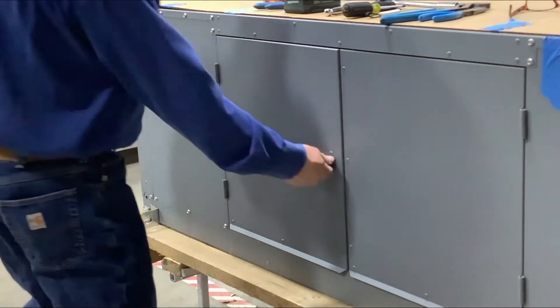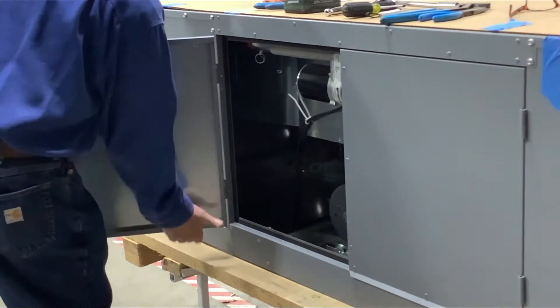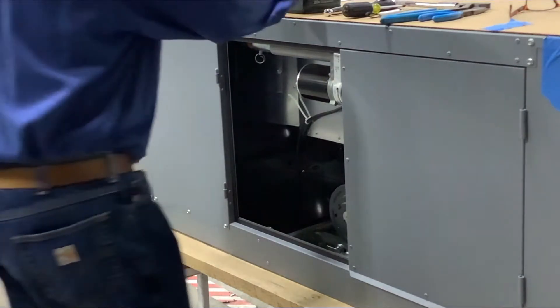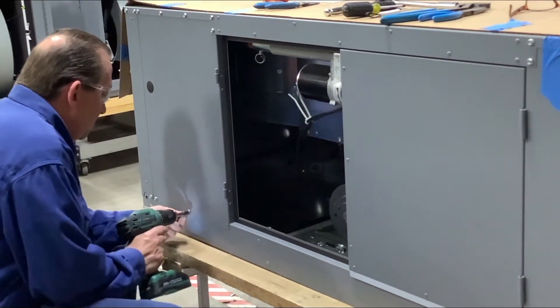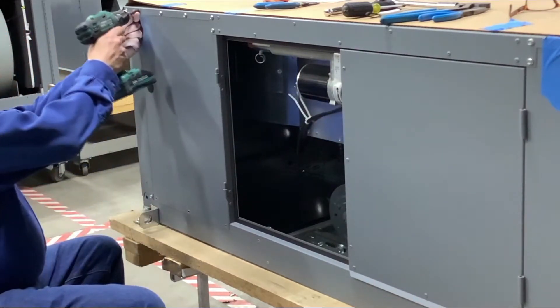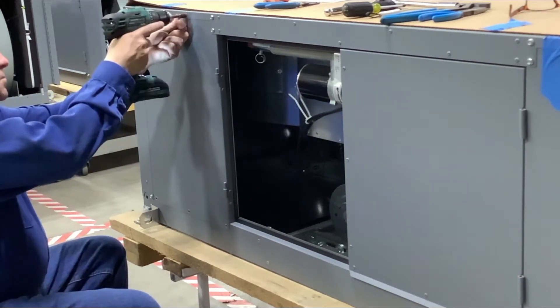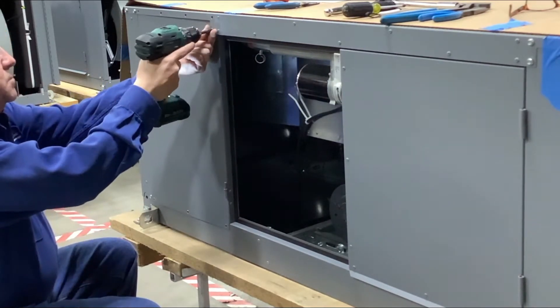On the opposite side of the heater, open the left cabinet door. Remove the door by pushing it up to clear the latches and set to the side. If the heater was manufactured in or after 2015, remove the damper linkage access panel from the heater cabinet to gain access to the damper linkage. This will be the panel to the left of the cabinet door. Remove the sheet metal screws around the panel to remove it and set to the side. If the seam between the panel and the cabinet is caulked, use a utility knife to cut the caulk.